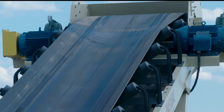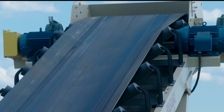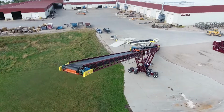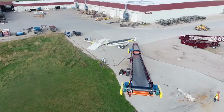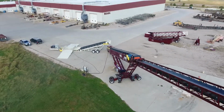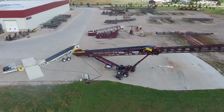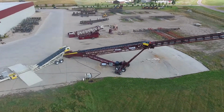To confirm that the belt head is tracking properly, observe the head belt pulley to see if the belt is staying in the center. Finally, before any truck arrives with the first load, confirm that the Magnum belts are running properly. Do one final walk around to ensure that the perimeter is safe and that both machines are running properly.